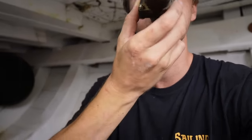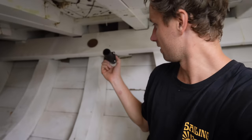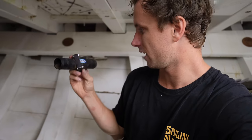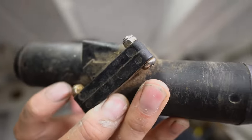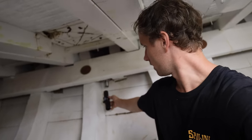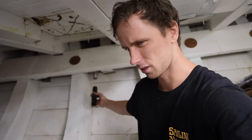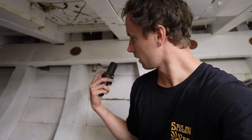Wait. I really hope it was a bilge pump before. But you can't blow the other way. I really, really hope. So, the way it flows, there's an arrow over there, is the way we want the water to flow, like so. And that's just gonna come here, you can fasten it or just leave it onto the hose or hose clamp it to the frames. And that allows water to leave and no water to come in.